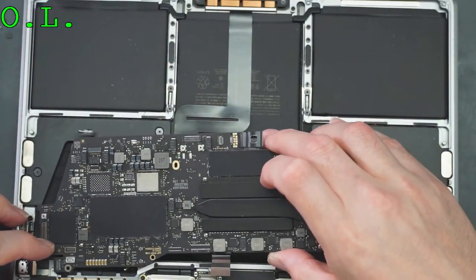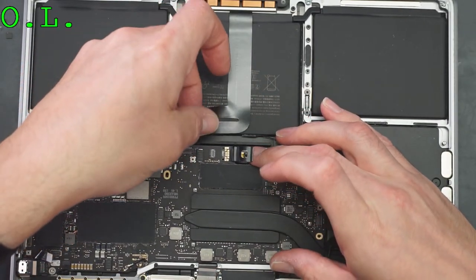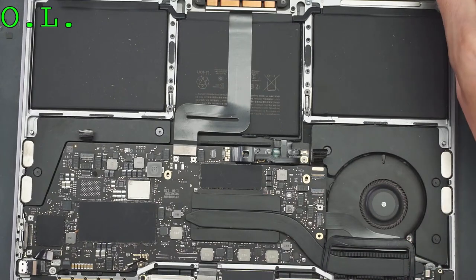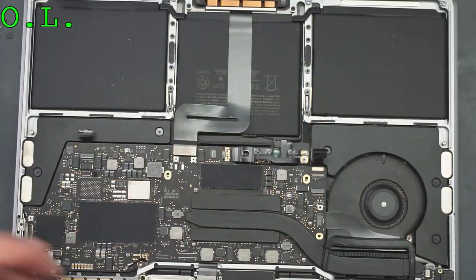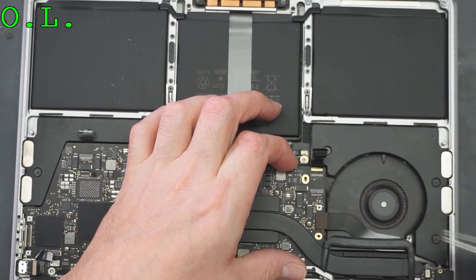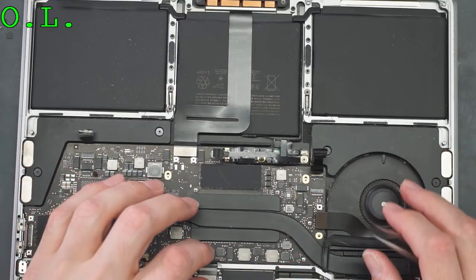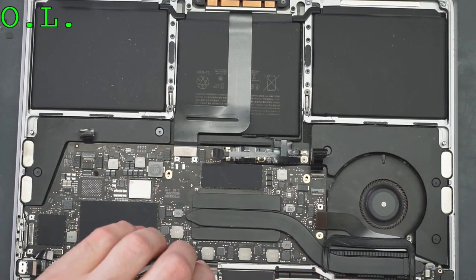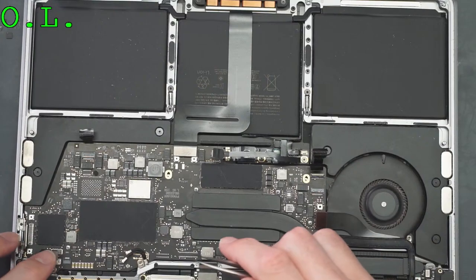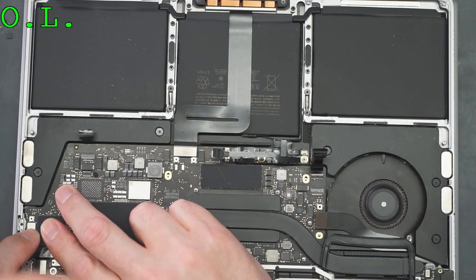What you do is find a donor board or a whole donor drive for your drive on eBay or something like that. There's a bunch of sites that sell donor drives. And you're going to take the board off of the donor drive, locate the BIOS chip, the ROM chip, and transfer your ROM chip off of your broken drive to your donor drive board, and then put the donor drive board on your drive, and you should be fine. It'll work just fine, and it'll work like that forever. Just don't overheat anything, and practice on something. It's just a little eight-legged chip on there, pretty easy to take off and put on. Just make sure you find the right board for your drive.